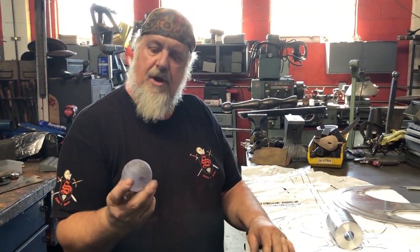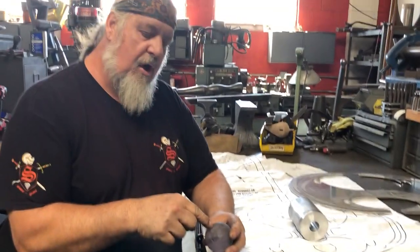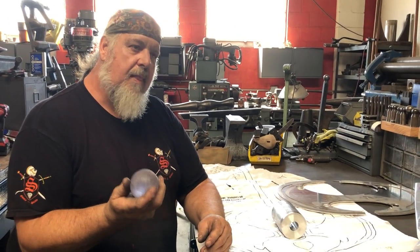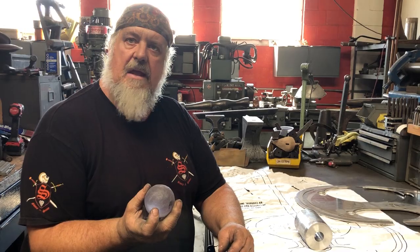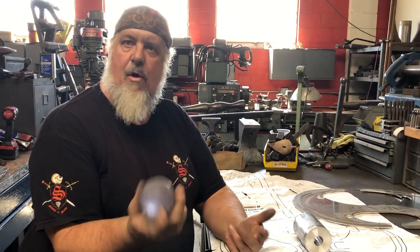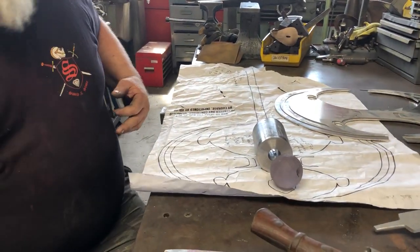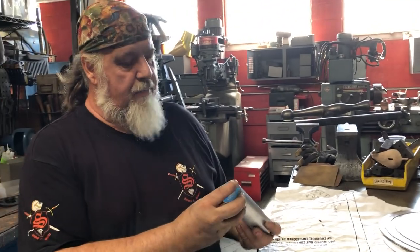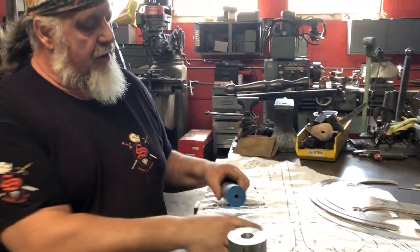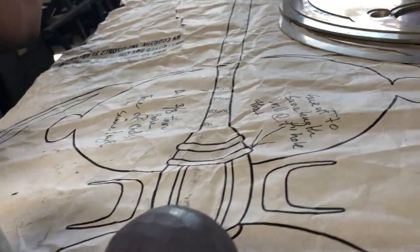I have a sphere machine that I'm going to put it in to refine everything and make it uniform, at which point we'll put a small hole in here to thread it with a quarter-twenty thread, and it'll also be covered with a translucent green paint. This one's not going to really glow, but it's going to appear glowing because it's translucent plastic. This is your collar up in here that'll be fit inside of it and then tapered down on either side, with the words drilled or etched into it.